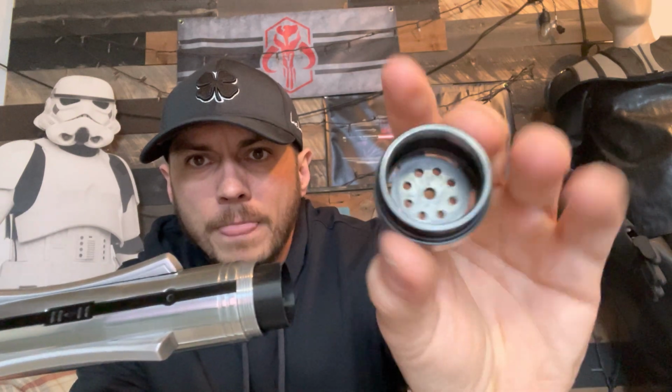So when you're putting this chassis in, that groove for the set screw is always facing up, right? So when we do that, that set screw is a complete 180 degrees from the switches. It pushes all the way in, and then it stops right there. That's how much you want. It's going to stick out because that is what locks into the end of this pommel cap. And that's why I've got your speaker pretty far in that chassis, so that this rim right here presses up against this guy, but it doesn't touch your speaker drum.